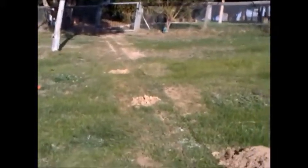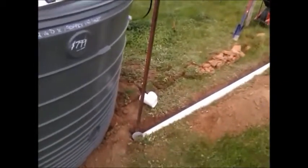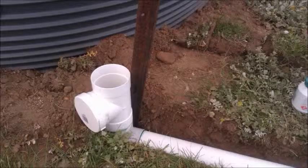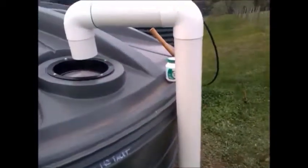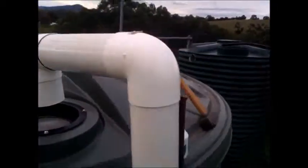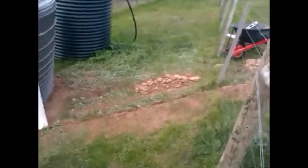Close-up view: after burying the pipe and putting the turf on top, the grass is still pretty green. This is the last bit to go in. Over here I've driven a stick down to tie the riser up against, and in here I put an inspection tee so once a year I can clean out debris. The elbow is connected up, and in here I put two elbows so the water should flow up, across, and down. Job done — just waiting for the rain. Hope it'll come soon; forecast says rain in the next few days. Thanks for watching.